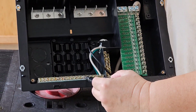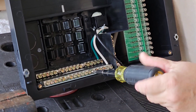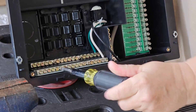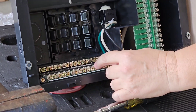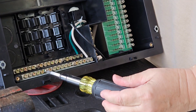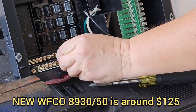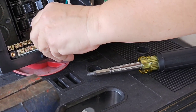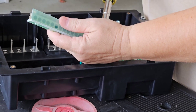Leisure went to this in the Unity models for the 2016 through 2019 models, but then in 2020 they switched to a true dual bus breaker box — basically this exact breaker box, but from the manufacturer the neutral bar is already separated into two separate bars. Those breaker boxes are very hard to find and certainly more expensive, so I just ordered this 8930/50 from Amazon and I'm going to cut the neutral bar in two myself so it can be used as a true dual bus bar breaker box.